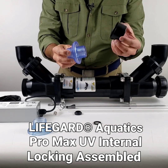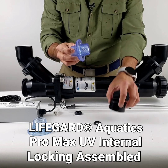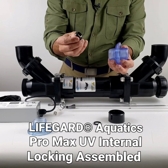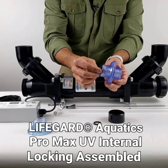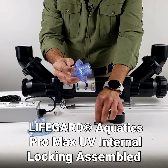In addition to the dual threads, there is a flat rubber gasket and a coupling that tightens it. Keep in mind that the UV quartz sleeve external seal is still the same — it has a tapering on one end and flat on the other. The tapering end goes in first into the housing.